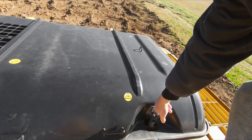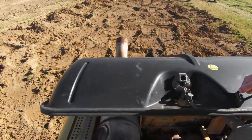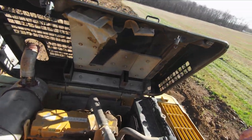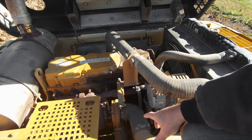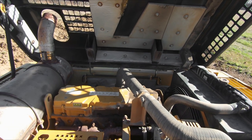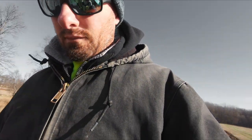Next, we move back here and do our table checks like we do on any other machine. I'm not physically checking all of these today because I did this morning and the machine is all hot. Here's the engine — you've got your oil dipstick right here. Your coolant is actually going to be down at the bottom. You're going to pull your oil dipstick and give the engine a general look, making sure there's nothing really sticking out that needs to be addressed before you start for the day.